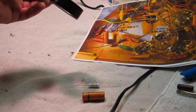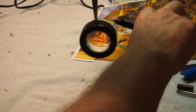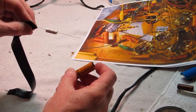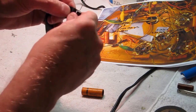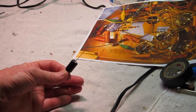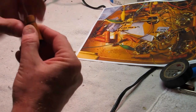Here's our black tape — just plain old electrician's tape. We pull off a certain amount, cut it, and begin to wind. Making sure one last time that this is the right value: .047 at 630 volts — we have .05 at 600, so we're good. We just begin to roll. So we have it wrapped up and ready to go. Looks pretty good.